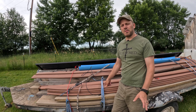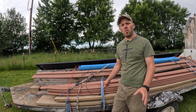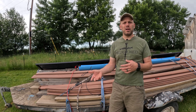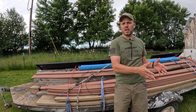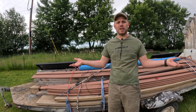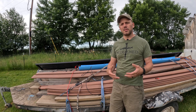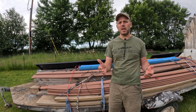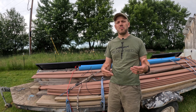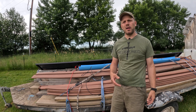So if I'm only going to get the same amount of power whether I do four panels or six panels, you might ask why I'd want to do six panels. Well, the reason is that in the morning when the sun is not as intense, in the evening when the sun is not intense, and also on cloudy days like today, I'll be able to capture more sunlight. I'll hit that 1600 watt peak quicker in the day and for a longer period of time, which will give me more charge time — ultimately upping my production and reducing my energy bill.